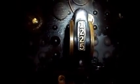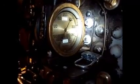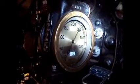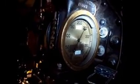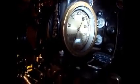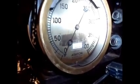But anyway, one big thing that went in is the pressure gauge is finally back in. And what's so great about this one is it actually has the engine number emblazoned right on it. It's nice and big, and it's got two faces, one so the fireman can see, and the other side for the engineer, so you can tell how high your boiler pressure is. The operating pressure on this engine is 245, and the safety is 250, but this thing will probably hold a good 300 pounds of pressure. I think that's what we've got to get up to for the pressure test for the hydro. But this one could go all the way to 400 on here. It'll hopefully never get up that high.